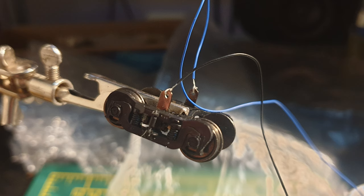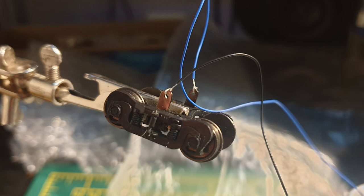But there was a snag. The strips are very thick, so they needed a high temperature to solder the wires on. I was not going to risk melting anything, so I opted for the tightly looped and soldered wire method. After that, it was just a case of soldering the wires onto the replacement board, and I needed to desolder a capacitor connection and, since I was feeling lazy, the LED connections.